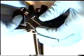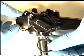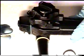Once you have achieved the up-down and left-right lock knobs to meet diagonally and to properly lock the left-right angulation knob, we will need to reapply the SP8KTR left-right trim ring. Using your black RTV, apply small amounts to the 3 set screw holes in the left-right lock knob assembly.